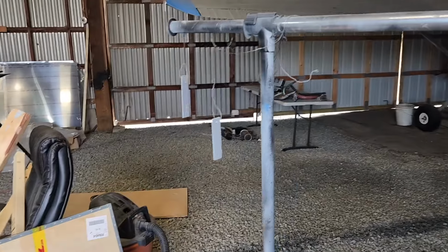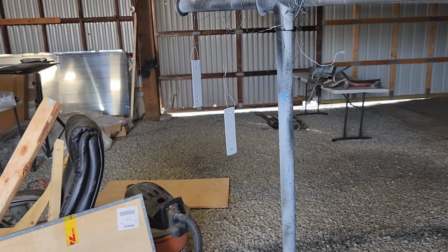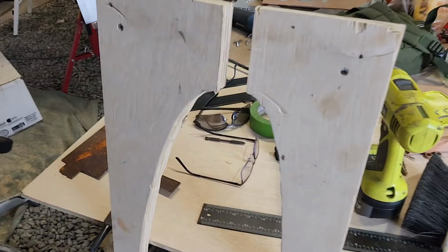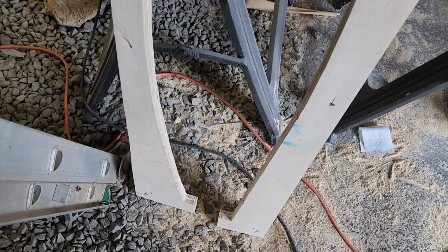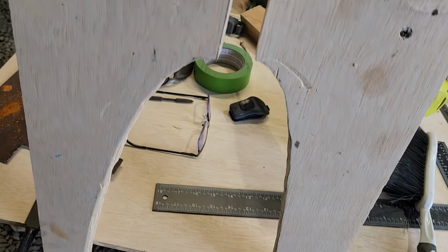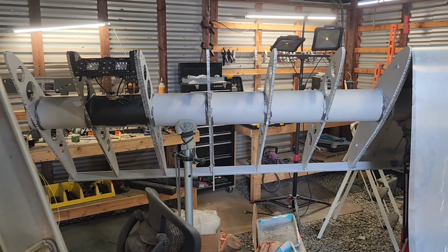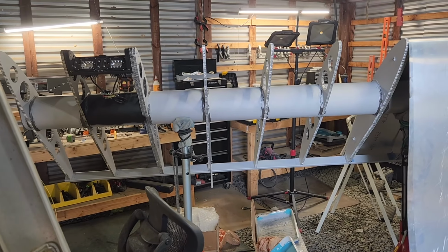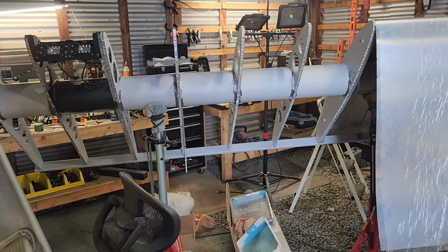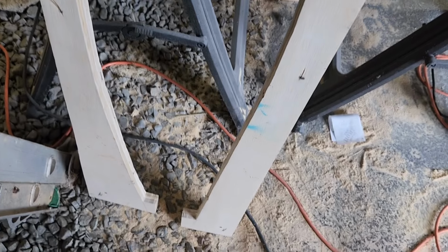The only other thing was building those little brackets for making the hinges. So that's the bottom end. And the other thing I need to do once this is all connected is get some thick weather stripping to put along the edge of that for a cushion for the clamp. I did put it up on there, and there's a good space all the way around. Maybe not quite half an inch, probably closer to a quarter of an inch to a third of an inch all the way around. So the weather stripping will have to be pretty thick, but I'm not super worried about that.